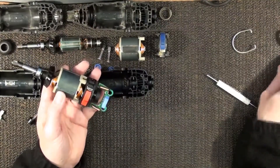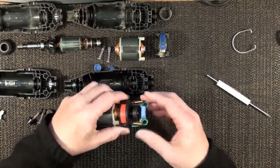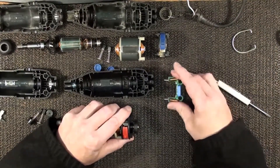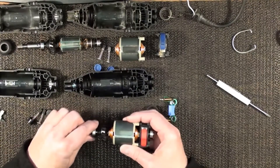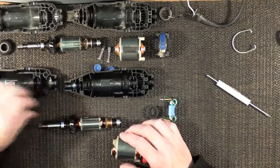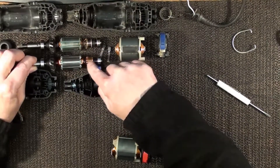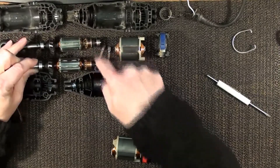Let's see if we can read what these are. This is a 100 nano at 275 volts — an X2 capacitor. And then we've got what looks like a 470 ohm resistor down there. CC1, CC1, CC1 and CC2 — I don't know why they call them that. I've never seen one called that before.